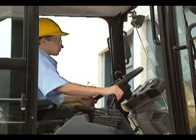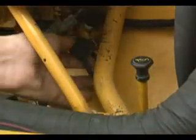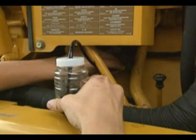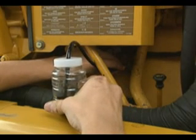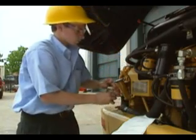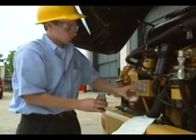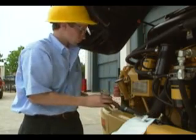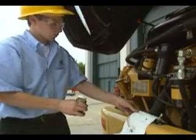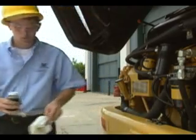Set the engine at low idle and remove the oil valve dust cap. Insert the probe into the valve and collect about 100 milliliters or four fluid ounces of oil into a waste container. If you use the prepackaged bottle method, you can use one of the bottles for waste. This process cleans the valve and helps ensure a representative sample. Please dispose of the tubing and oil in the waste container properly.